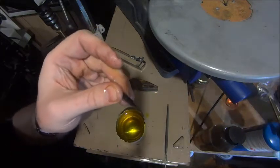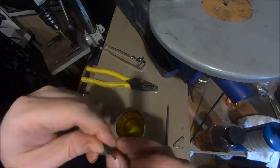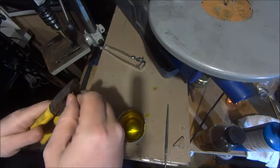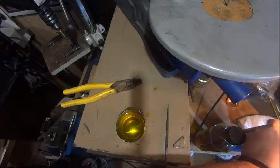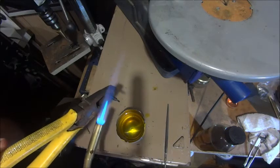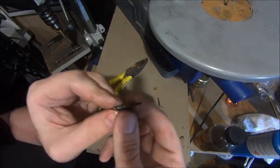I'm going to put him back in the faceting machine now and we're just going to give him a bit of a polish up across there so we can see the colour in it again when we temper it. That's given it a few rubs and brought the polish up again. Now we want to temper it - we don't want it real hot, it's probably straw. We're going to drop him straight in. So we start the gas up again and we just want to heat him up there so he starts to change colour - then drop him in oil. So we should have a good hardened and tempered D-bit.